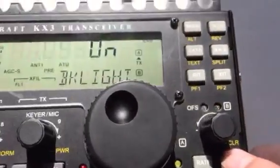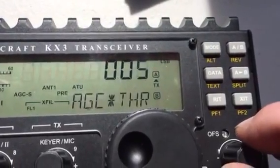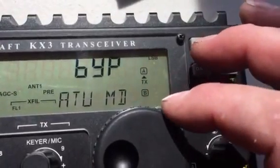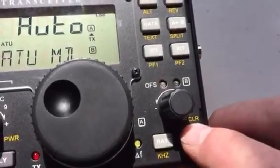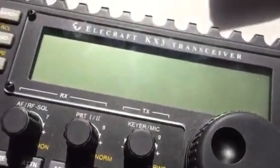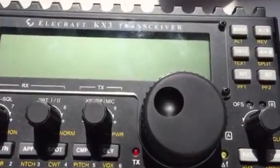Go into your menu by holding the disc for at least three seconds. You can't see if you've gone past it — hang on. There. ATU mode — probably set to bypass or not in use. Switch it to on. Press the menu OK, exit, power off and we're done. Tighten everything up, put your batteries back in. Just bought this, just dropped the module in, don't know a lot about the radio yet, so as I find out a little bit more I might post a bit more. Thanks for watching, 73s.